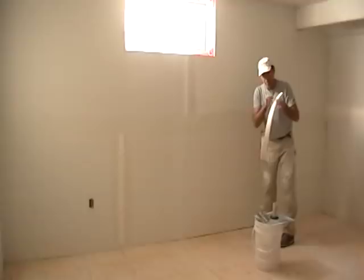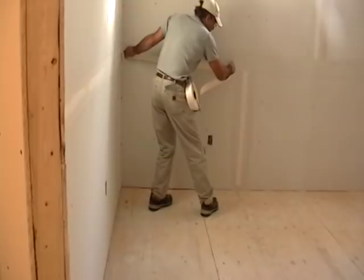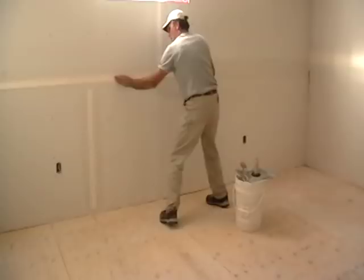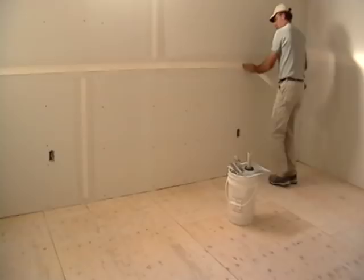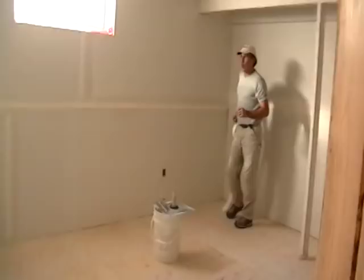Now is when we want to tape on there. I'll find the creases and start at that end — again, the pointed part goes towards the drywall. With my finger I feel where the two pieces of drywall come together, and that's where I want to put that little pointy side of tape. My other hand pushes it down tight to the board, just to make life a little easier, and all the way to the end. I can stop a half inch short at the end because the corner tape will be joining that piece of tape going across.